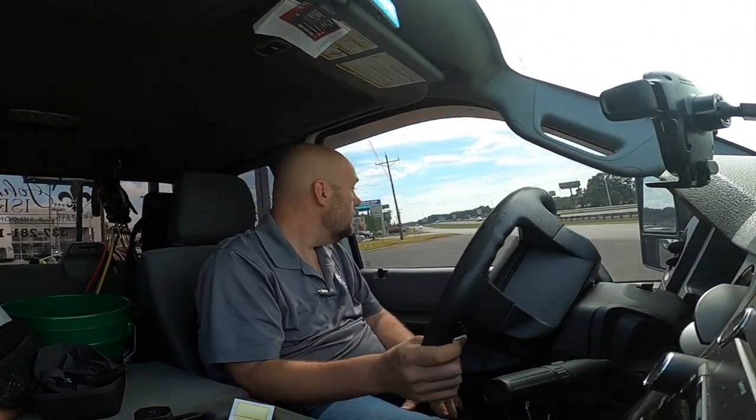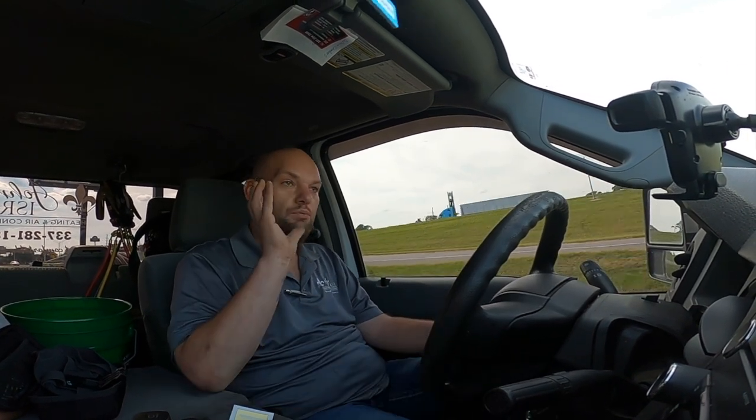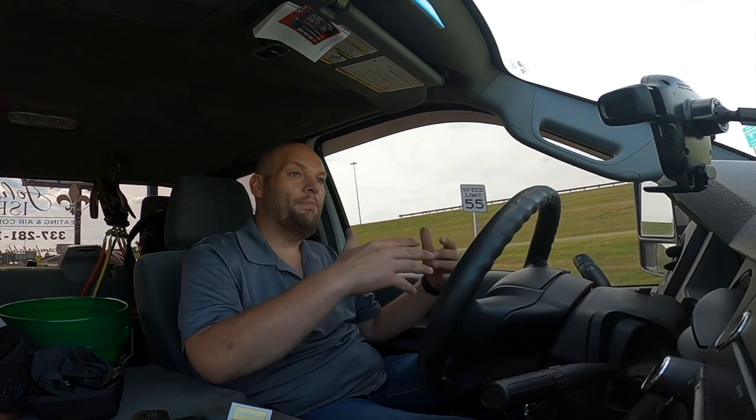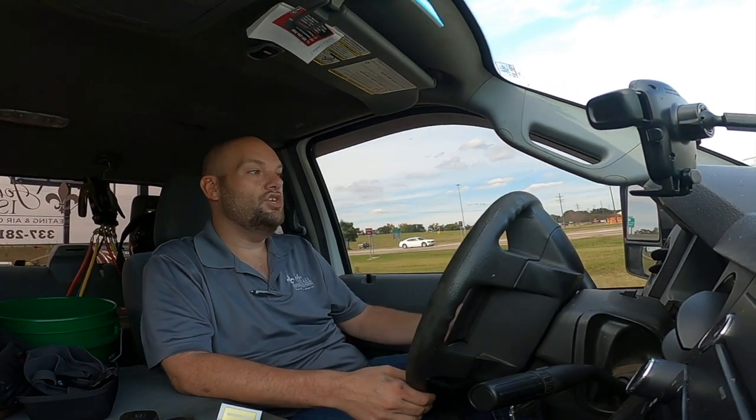Anyway, I have that mentality in my head of heat, that I have a heat pump outside. So I always go down on the electric heat kit. Like, this was a 5-ton system that you're gonna see. On the old system, all we did was change the air handler because the people are selling the house. But I was so used to having a heat pump outside, they had a 20 kW heat kit and I dropped it down to a 15 kW. I'm thinking heat pump outside, they don't need 20 kW worth of heat. They don't even really need 15, but I went ahead and put 15. But I don't have a heat pump outside. I got a straight cool air conditioner.